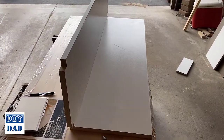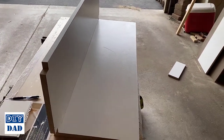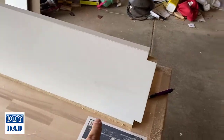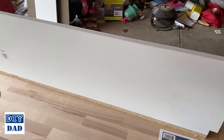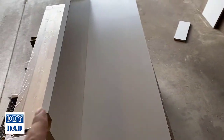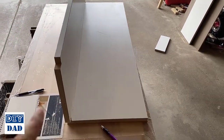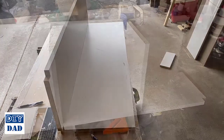All right, back piece is cut. I have the back portion laying flat with the bottom coming up now, because the next step is to cut pocket holes in the bottom of this piece going down towards the back. I'm going to do probably about 5 of them along the length, and then I'll screw those 2 together so that's nice and tight, and then we'll measure out and do the divider pieces as well. This will then get flipped back over and we'll have the basic structure of our box. At that point we can look at connecting the legs to it and then getting ready for the top.